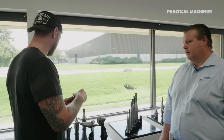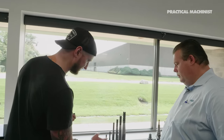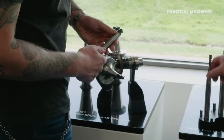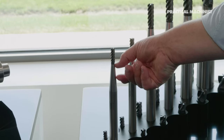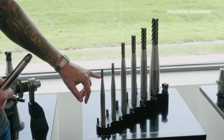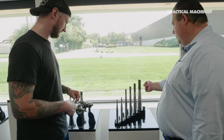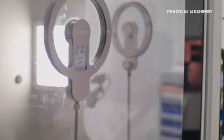What's the difference between one with a taper and one that's straight? It's all about being able to get deep into a cavity and close to a wall. You've got more depth of cut — where this end mill might be 1-1/2 inches long, you still have another half inch at that diameter allowing you to get deep and close. And if that's a 1-1/2-inch length of cut you could also swap out for a half-inch or one-inch length of cut on that same tool body.